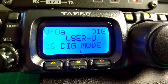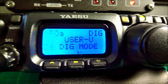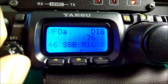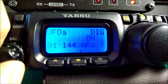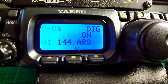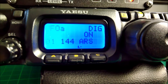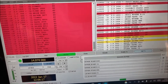Menu 26 set to USB — the reason I picked that was because HF digital modes are all predominantly upper sideband. That's really the only settings I changed. What I'll do now is show you the settings in WSJT-X and just show you it communicating with the 817.